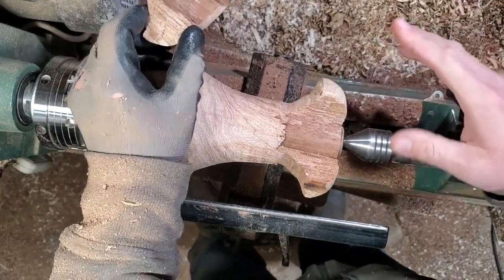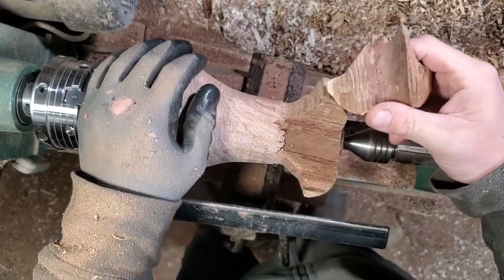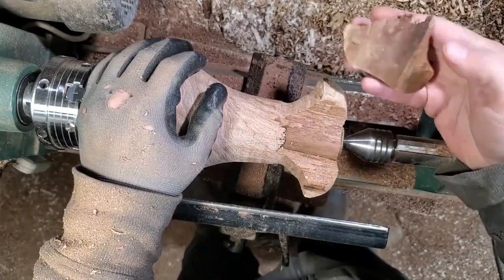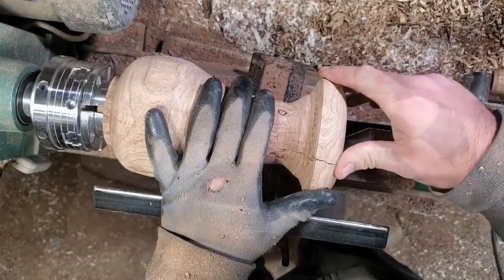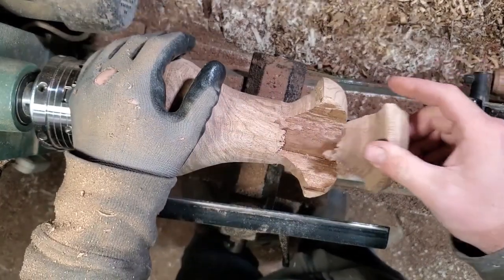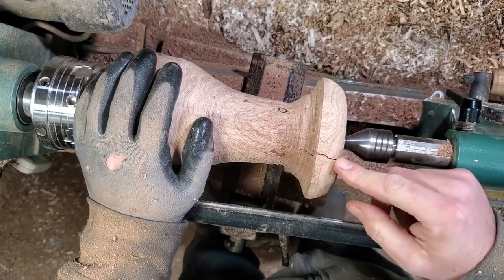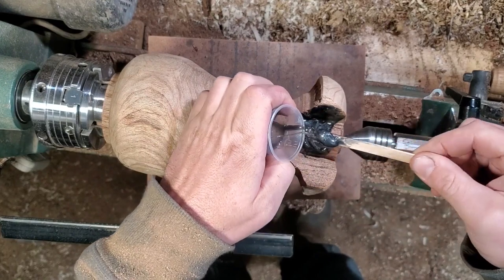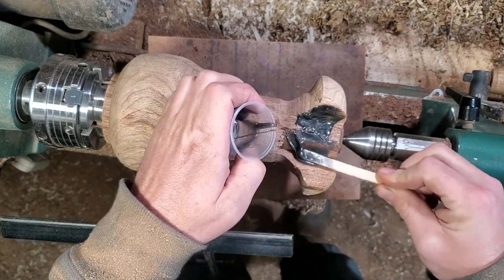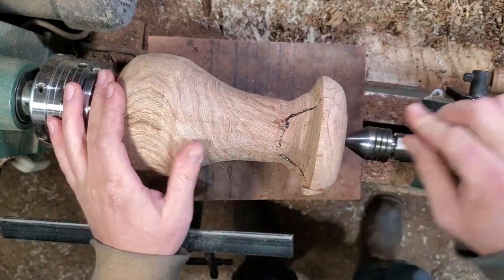Makes me wonder — should I continue with this piece, am I just going to keep having that issue? We're going to epoxy this back in. Normally I would use wood glue but you're still going to see a crack, so I'm going to get some five-minute epoxy and some black dye and actually try to accent that crack. If I dye my epoxy, at least any squeeze-out is already black — I don't have to worry about having some black spots later and some not.